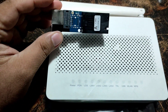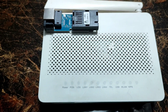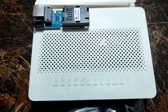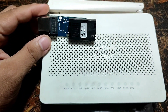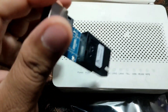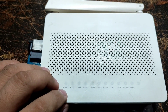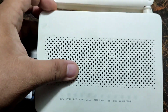We're going to insert this device inside. Maybe some of you are asking why I should do that. As I showed you last time, I already have the OLT. However, it's EPON. As we know, EPON is limited to 100 Mbps, and one of our clients is requesting more than 100 Mbps — they want 300 Mbps bandwidth. So it's a gigabit port, and we're going to tap this gigabit port to LAN 1 of this Huawei 5B5.